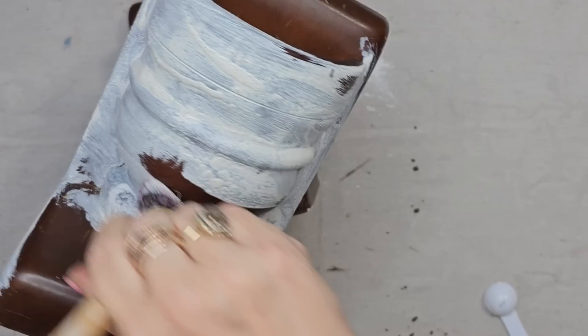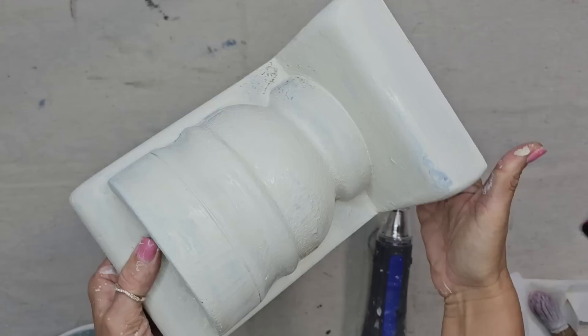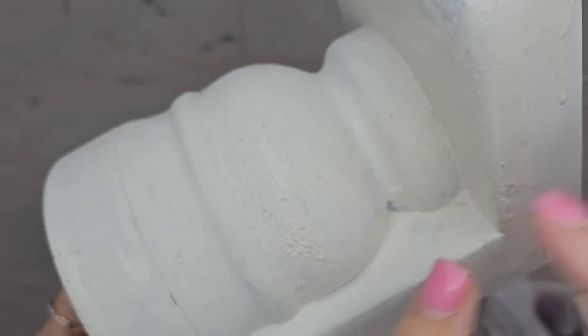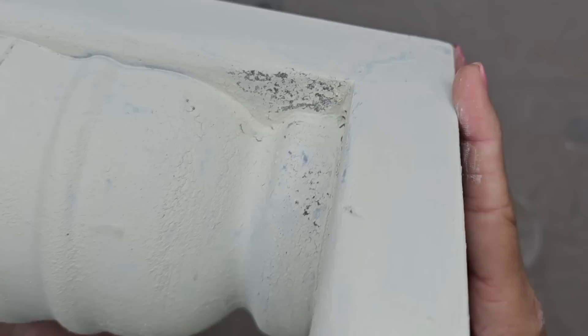This is what it looks like after one coat of paint. Now I'm going to go ahead and put the second coat on. When I have my last coat of milk paint on, I like to take my heat gun and apply heat to it. When you apply heat to milk paint, it kind of makes it dry in place and gives you tons of texture, and a lot of times it also makes it chip. My bookends are all dry — let me show y'all some beautiful closeups of all this amazing texture and crackle we got. This is why I love milk paint.